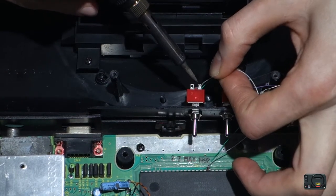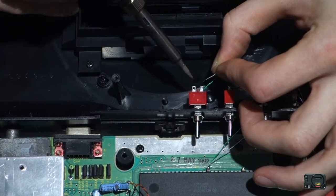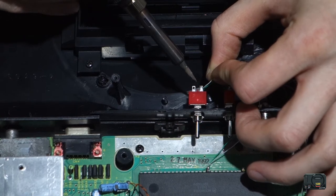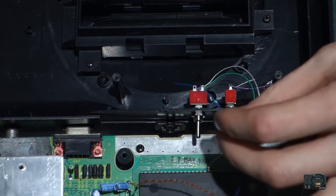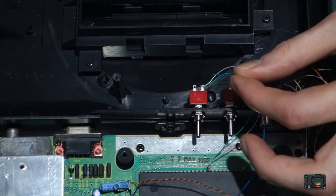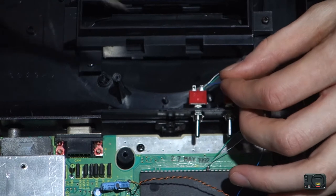Now one thing to remember, actually, which I haven't mentioned, is that you need to keep these cables as short as possible, because you get interference on the cables, obviously, and that messes with the overclock oscillating chip, basically. So you need to make sure you keep them short. I've got mine about roughly 4 inches long. And they say you need them about 3 inches, but 3 inches for me is just too tight to work with. So I wouldn't go any longer than four inches for each of these wires, the blue, green, and the white cable. Four is the max.